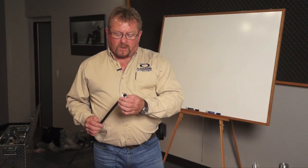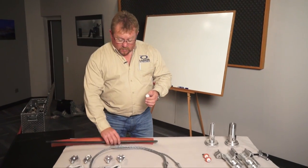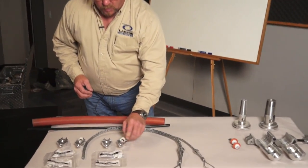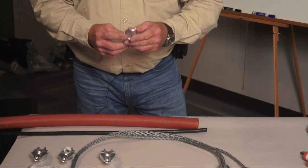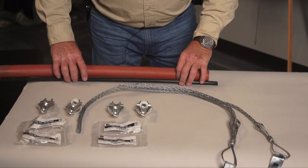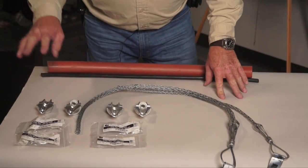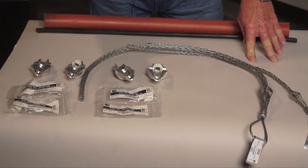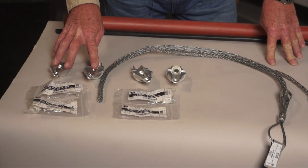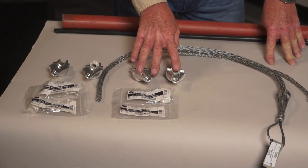The cable count does not give us the outside diameter. Once we get the seal decided — whichever one fits on the cable the best — we can then choose which venturi fits the seal for the cable size we need. These venturis come in a cable pack: you'll have two venturis and four sets of seals. Two seals fit in the smaller venturi and two sets of seals fit in the larger one.